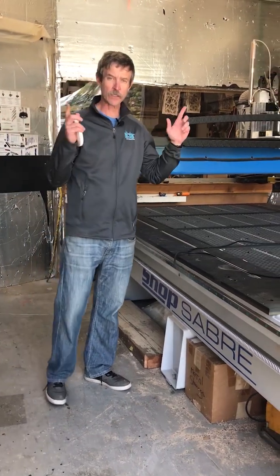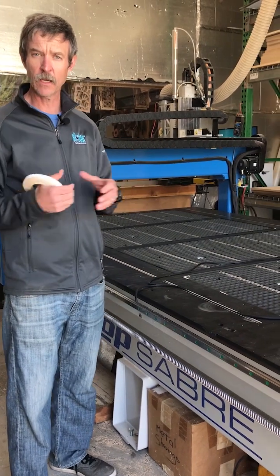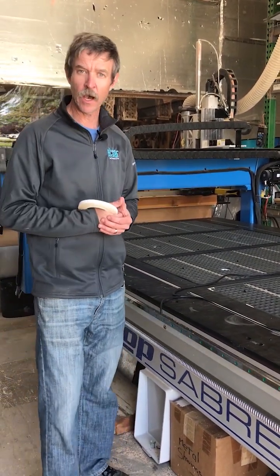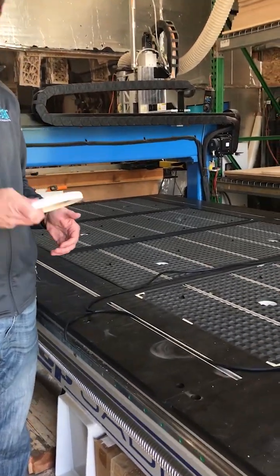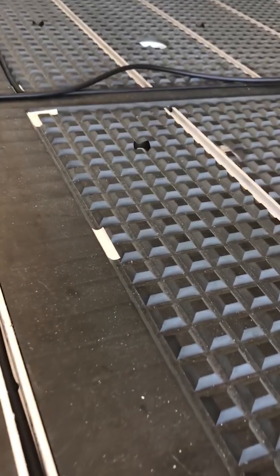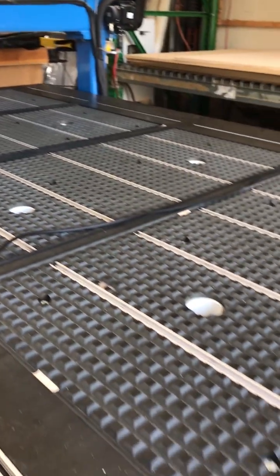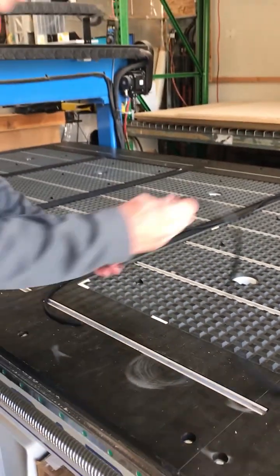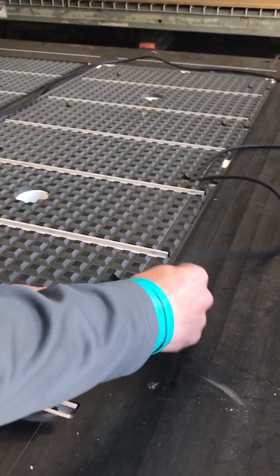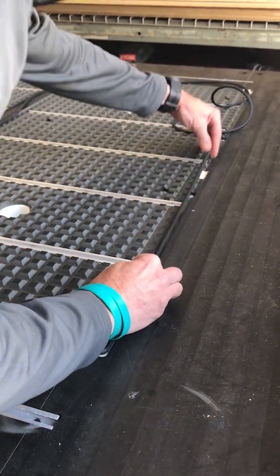Now that we've got the spoil board off, we're going to start putting this grid gasket into the machine. As we always say — square gasket into square holes, into square channels. But when you have a unique channel like this, round cord. We often supply a double-sided tape to keep that round cord in there, otherwise it's going to twist around and come out of that channel. We really want it to stay in place. When we put this gasket material into this channel, we're going to go all the way around the perimeter, as we've done for the other three zones, to really seal that table.